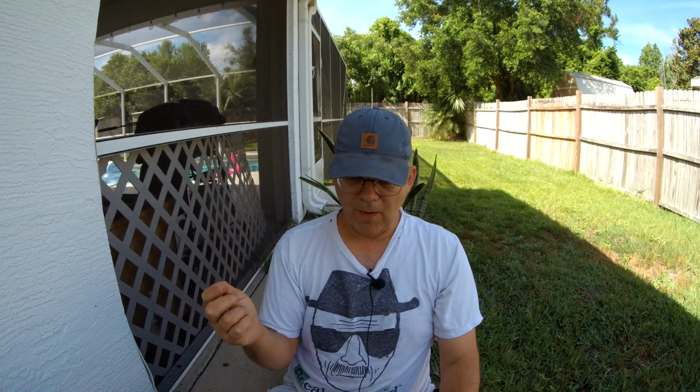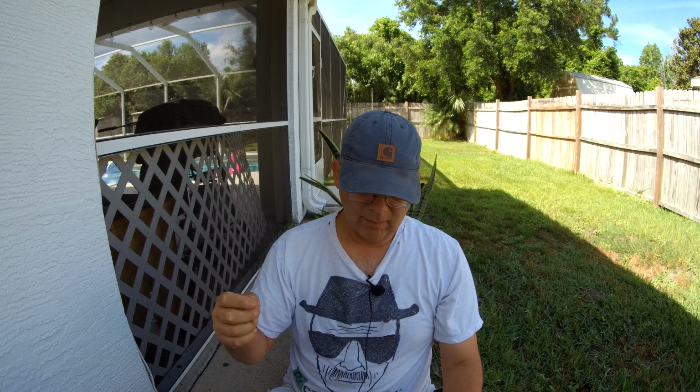So I had a problem with this Firefly going off. What I did was I put a memory card from my phone in it because I forgot to put the memory card in it. So I took the one out of my old phone and put it in here. And then I went to record, and it would record for like 30 seconds or a minute or 2 minutes or something, and then it would just stop. And what it was, the card was too slow.